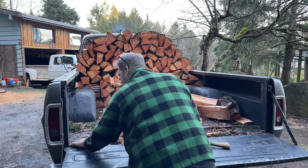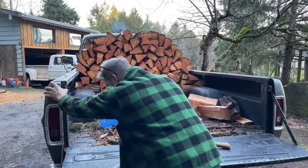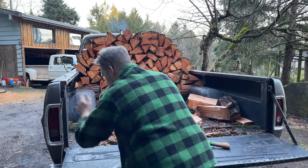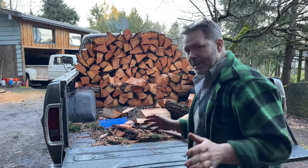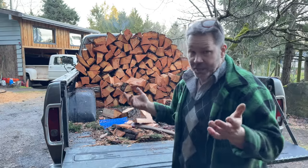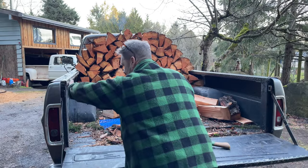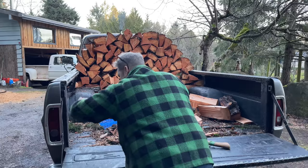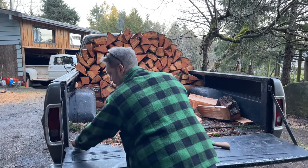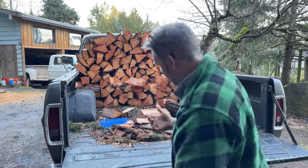And it's right here. You can actually see it. It's broken. It flexes. You can see it. And I'm not going to flex it any more than it already is. I'm actually going to gusset it. I'm going to make a weld. I'm probably going to get a piece of flat bar, weld it up against here, and weld it against here, and put a small little gusset right in there. You may as well keep it strong, right? So that's the deal with that.